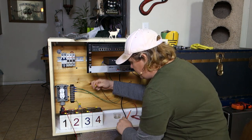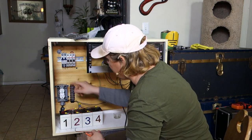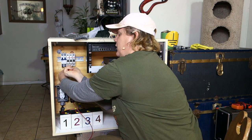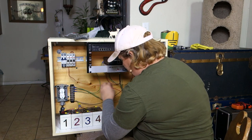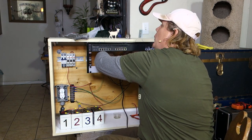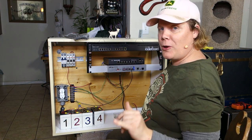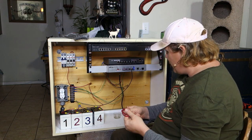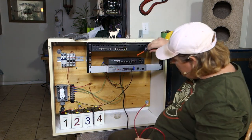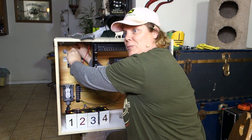There's our positive and negative. We're going to slide these into the battery terminals — it says 'battery' right there, so if you hook it up wrong it won't work, but fortunately there are also fuses on here. First we'll hook up the negative, and then the positive for the battery bank goes through our battery breaker — slide that into the hole and tighten it up. That is now tightened and I can plug that into the battery bank.